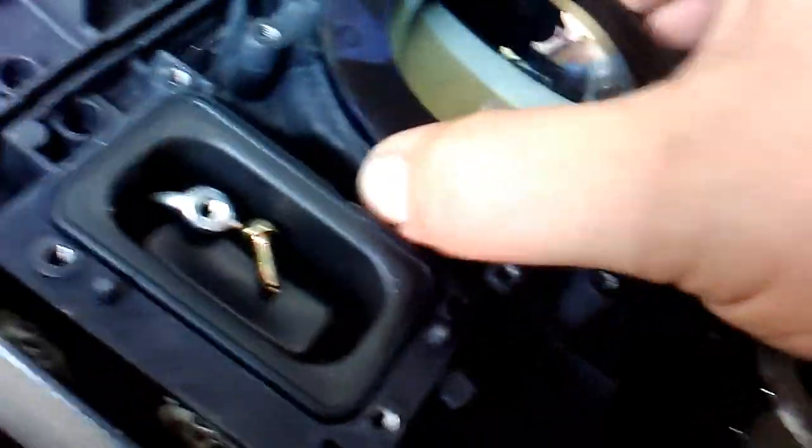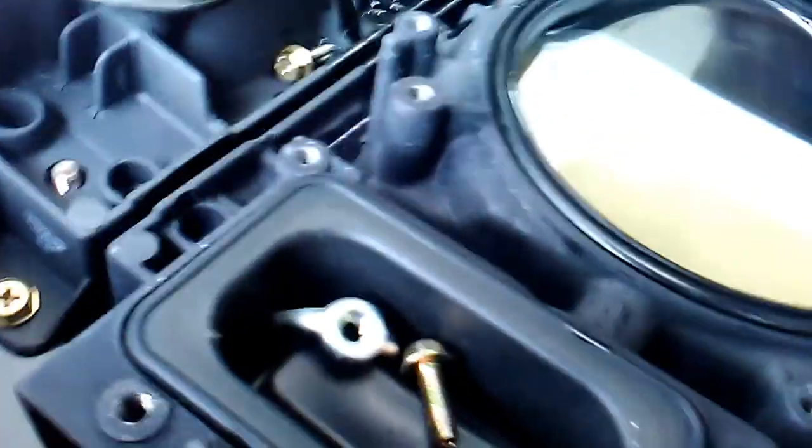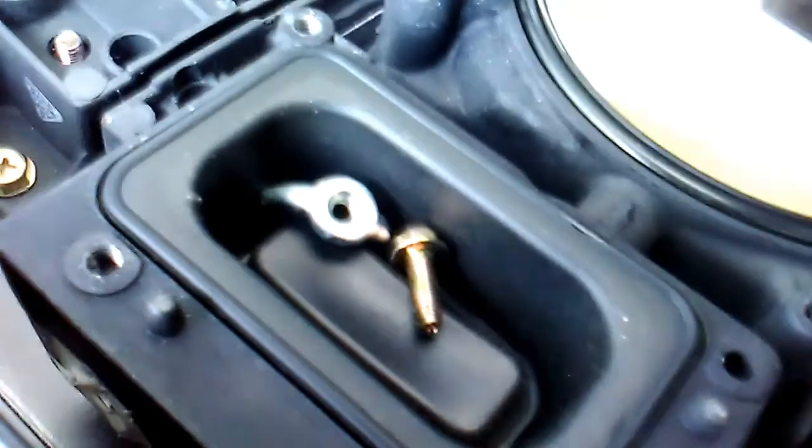Just a little warning: you take this inverted cone here that was down in there, and that's actually full of some kind of oil. The lens actually sits in the oil, as you can see. Just be aware — that's gonna make quite a mess, so roll that down and get rid of that in a responsible manner.